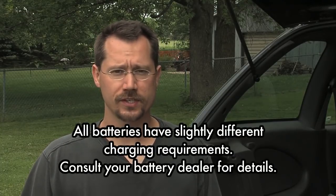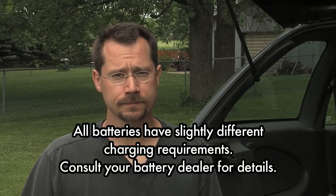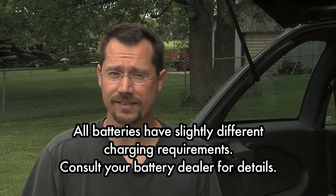Keep in mind that flooded batteries can produce hydrogen gas both when charging and during use, while sealed batteries don't produce hydrogen gas in typical use. Flooded batteries are also easier to charge — if they're charged at a higher voltage or amperage some electrolyte can boil off, but you can simply replace it with distilled water. Sealed batteries are often more expensive and may have charging restrictions. For example, gel cell batteries must be charged at a lower voltage or you can damage the electrolyte, while AGM batteries can often be charged faster but tend to be more expensive.